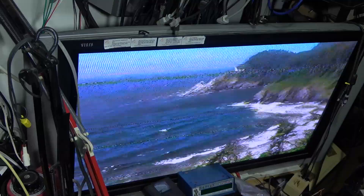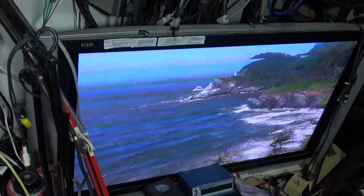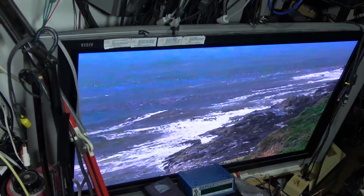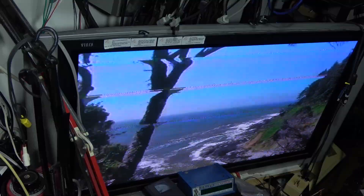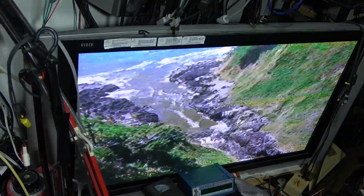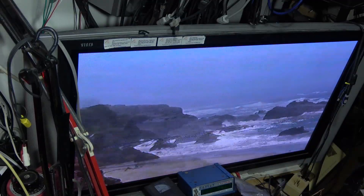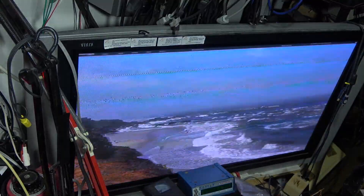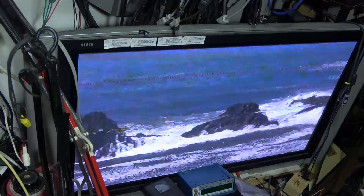Going the other direction is going to be totally the opposite — it'll be even more lines. We have to go the other direction. I went counterclockwise to bring the guides up; going clockwise takes them down. I'm not sure I'll have enough adjustment to do that. Probably not, but we'll see. And of course if you hit the tape you cause it to eat the tape — don't slip when you're adjusting guides.